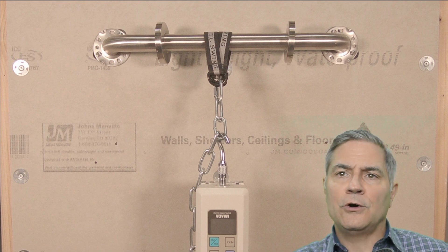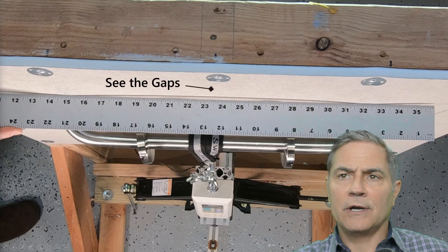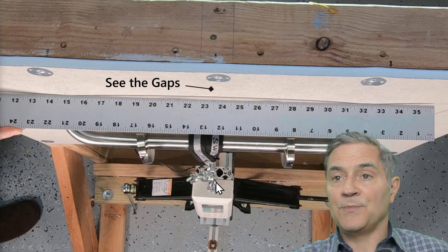As we mentioned earlier, we noticed the wall was flexing, so we decided to run another test on the Go Board by itself. I was surprised to see that the board flexed up to 3/8 of an inch towards the top of the board. You can see we're about four to five inches from the very top where we bolted in, and you can see the gap in the middle and to the right and left. As we ran this test even lower using both the toggler bolt and the Wingets, we noticed there was more flexing coming from the middle.